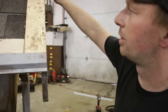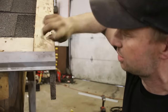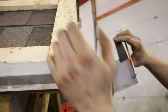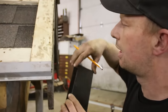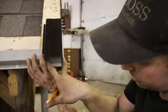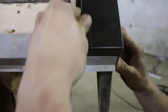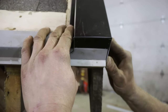Years ago we just used drip edge all the way around but you could see the cut edge — you want to have your steel hanging out past the drip edge. The new stuff we use now is much nicer because it takes the steel, brings it to the edge, and basically covers it all up. You don't have to be 100% perfect — get it close to within a quarter inch and put this nicely over top. I hate looking into gaps, so I make about an inch cut, fold this down, and make a straight cut down so birds and bees don't make nests in there.